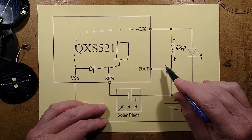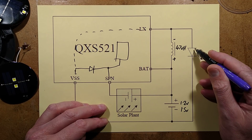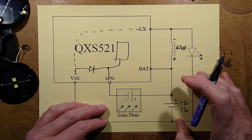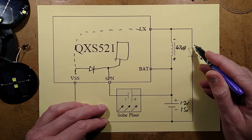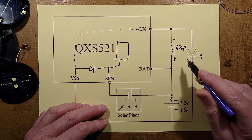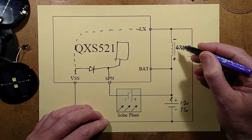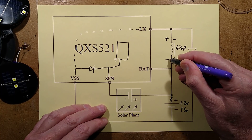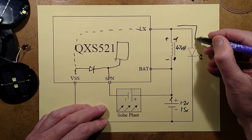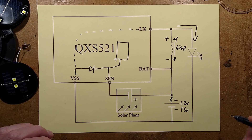In the case of a white LED, it needs about 2.4 volts before it starts conducting. So 1.2 volts, or a peak of 1.5 volts when fully charged, is not going to drive it directly. If you've ever seen solar lights where holding them out in daylight makes the LED light up, what's actually happening is the battery has failed and gone high impedance, so the solar panel is effectively lighting the LED directly. In normal boost operation, this end is connected to the positive battery, this end gets pulled negative through the circuitry, then it turns off - at which point this end goes positive and goes in series with the battery, adding voltage on top of the battery's 1.2V so current can flow through the LED. The LED is actually lighting as a series of very high speed pulses.